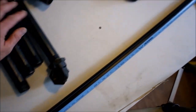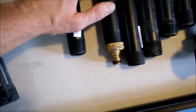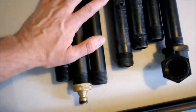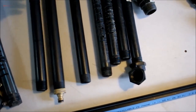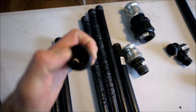Your other options are poly risers. They come in 3 sizes generally — if you go to an irrigation store you can get them even longer. So you've got 30cm, 37cm, and 45cm, at about $3.50, $3.90, and $4.50 respectively. Still pretty cheap, and they're 25mm fitting.